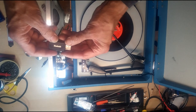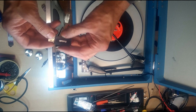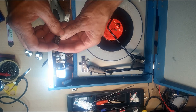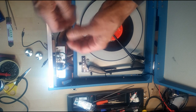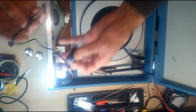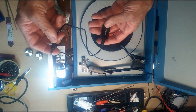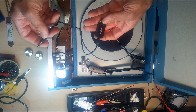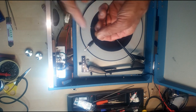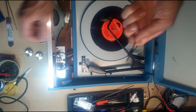You'll also need a Bluetooth adapter. This is a little USB one. You can pick these up for a few pounds on eBay or AliExpress or whatever. They're just a cheap little thing and they work fine. They come with a short auxiliary lead like this. Simply plugs in there, and the idea is you'd plug that onto your audio in on the device you want to use. But in this case, we're going to cut that off, and that will go onto one side of this switch.